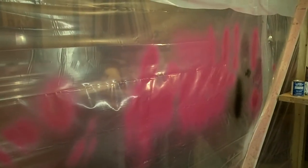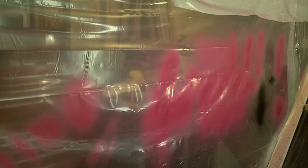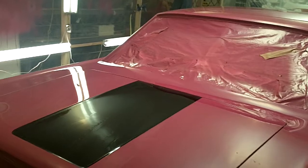I think some of the trash we might be getting is the spray on the plastic lifting. Maybe you come in here, test your black on the wall, get your spray pattern adjusted, and it dries over two or three days. Then you come back and shoot some pink, and when you go to test that pink, somehow this black flakes off, goes airborne, and flutters around in the air like confetti and ends up falling in your paint — and by the time you've done all this, you're already in the process of spraying.